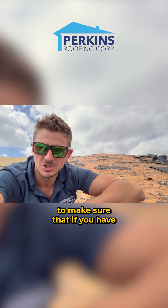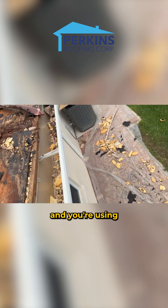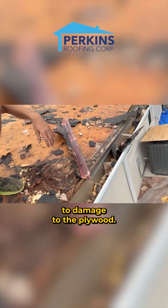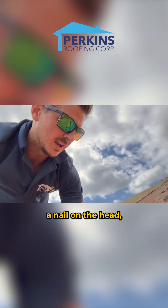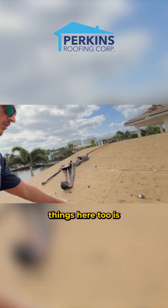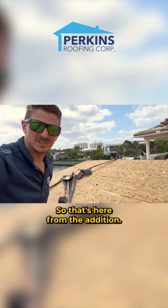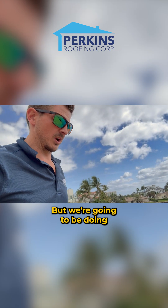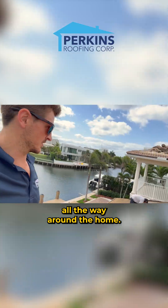It's very important to make sure that if you have copper on your roof, you're using the correct fasteners and the correct gutter hangers if those items are going to be touching, to avoid damage to the plywood. So what we're doing on this house — we are going to be going back with aluminum. There's also an addition here with decks, which makes for a kind of a weird situation, but we're going to be installing aluminum drip metal all the way around the house.